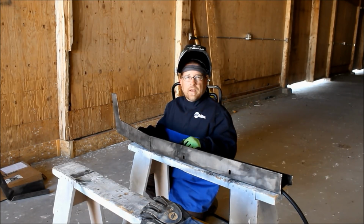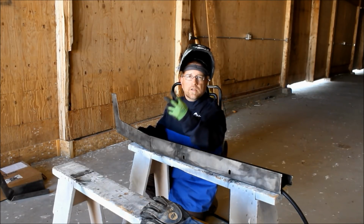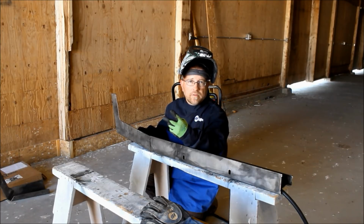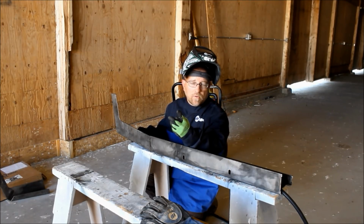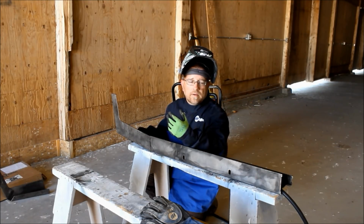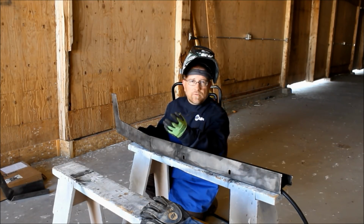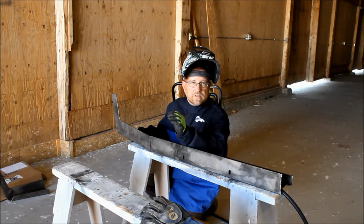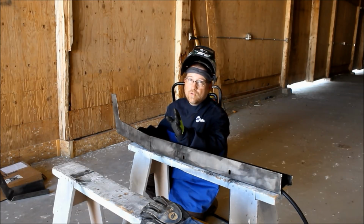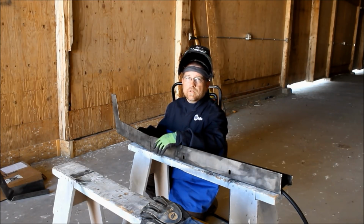So now when you weld, there's two things that you need to consider. One is wire speed and the other is how hot you're going to run the gun, or the amount of voltage you're going to put through the wire. And that's dependent upon how thick a wire you're using. You generally get a feel for the way it's welding and the way it sounds after you've welded for a while. But to take all of that guesswork out of the equation, Miller has what they call an auto set feature on these welders, which is super handy. Let me show you how that works.